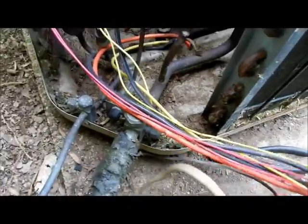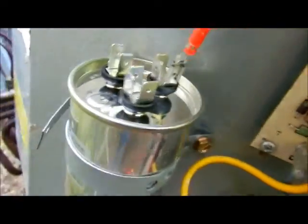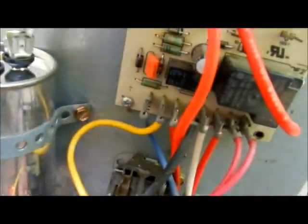So now let's look at our board here. I do remember where everything came off. This is sideways. It sits actually up like this. So the red and the black went on the terminal right there. The red on the other one right there. And a Herm, where it says Herm on top of the capacitor. The one closest to me is where the yellow went.